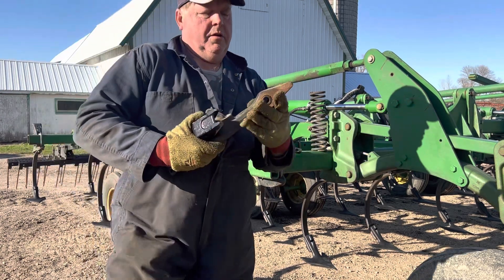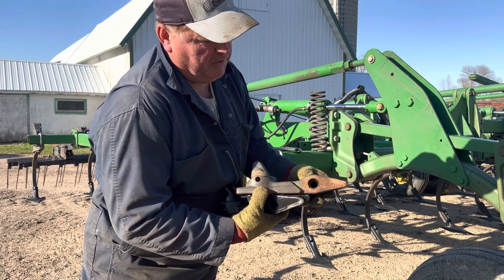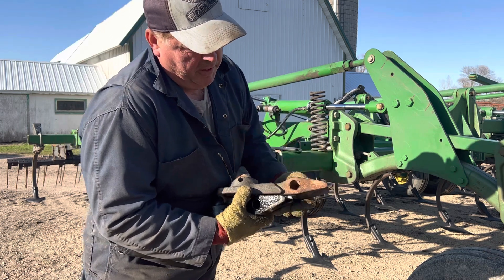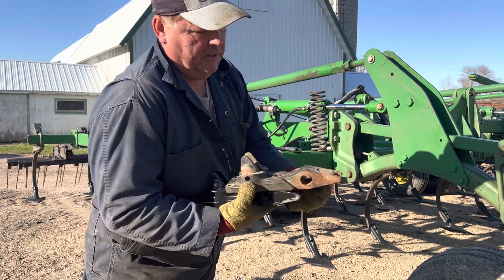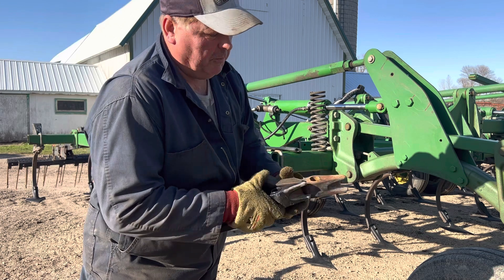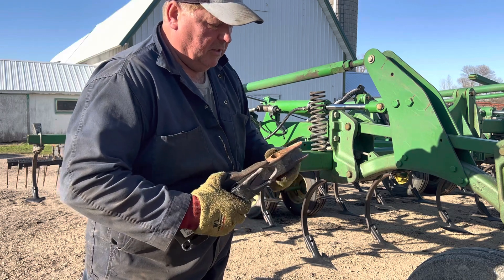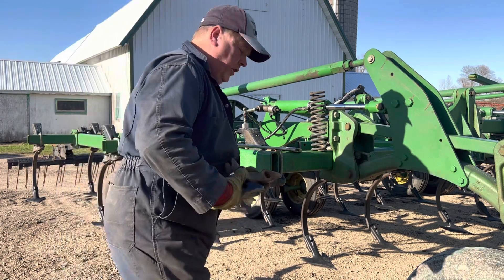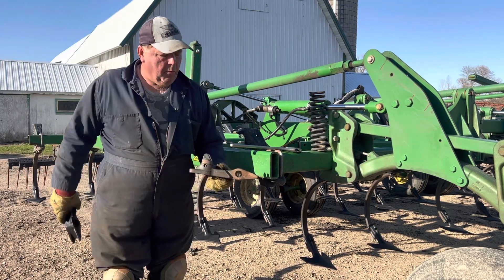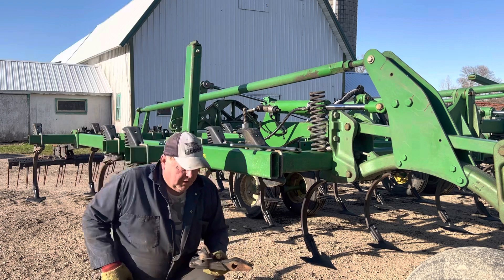You can see that obviously these two are the same things, but what I've got here is a piece — and I have a brand new one that goes in here. They have an inside bushing and an outer bushing. Look — I've got the inside bushing all in crumbles. You can change the bushing just by themselves, but sometimes what I decided to do this year is just change all of these out, so they have really nice tight shanks up in the front row. I can probably use some of these for parts if they wear out, because if they go too long, that gets to look like an oval — like an egg.